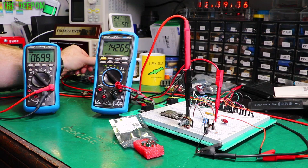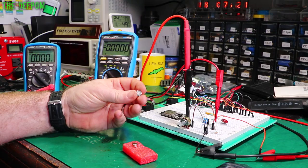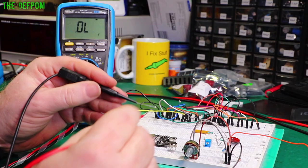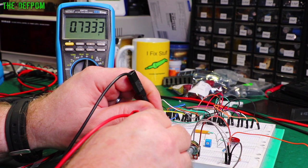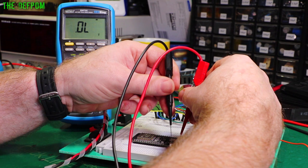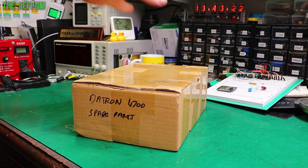Next I look at the LM394H — these are actually a matched dual transistor pair, a special device. I'll stick this in a breadboard and probe the pins with the diode test function. We have a diode junction, and another one — that's looking promising. Testing the other orientation as well — this might actually be real, that'd be nice. That appears to match a dual transistor setup. So that's all those parts sorted out — they seem basically okay, apart from the ones I'm not sure about, which I've put to one side to check more thoroughly later.